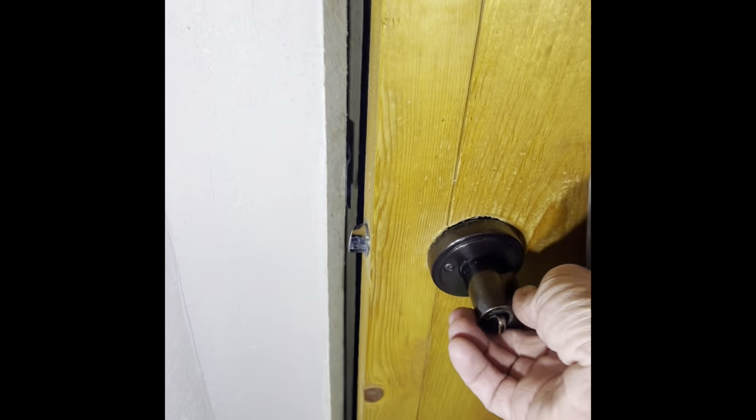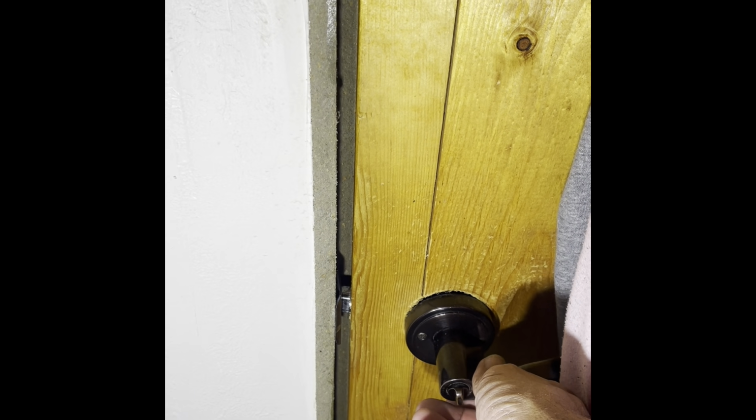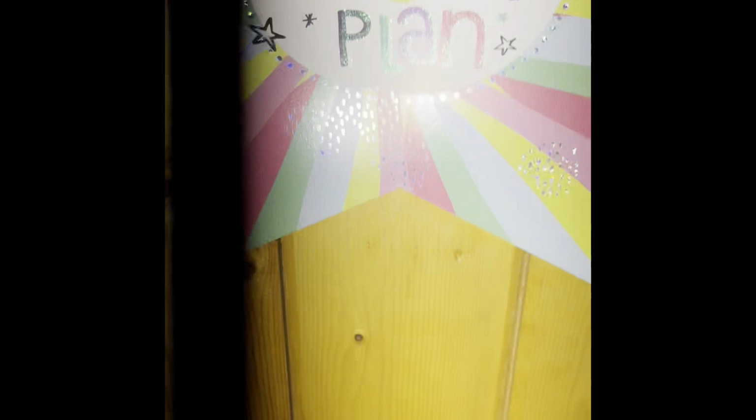And let's see what else we got here. I always mention I love having the arch top doors. They're so nice. And a simple way to do that, I was using Trex decking, the fascia boards, which are a 1/2 inch thick. And you just rip them to the size you like, and you wrap it around the opening. And there's your opening. And then you just match your door. You hold the door up there and you scribe the door in. You're ready to go.